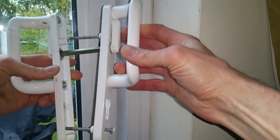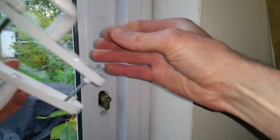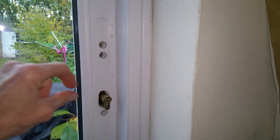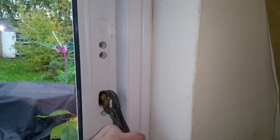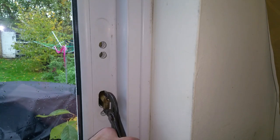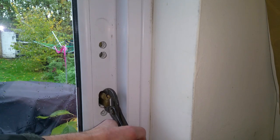From the inside you can lock it with that and do a final deadbolt lock with the key. What we've got to do now is break this - there's a very thin piece of metal at the bottom which is a weak point. I'm going to get the water pump pliers and just wiggle it until we break it. I think I've done it.